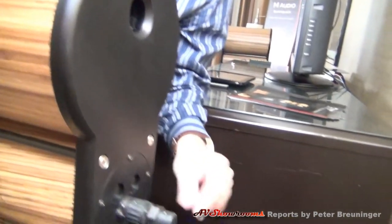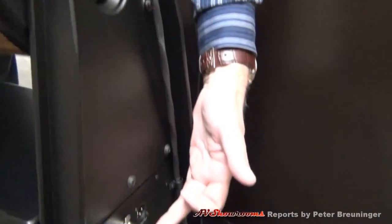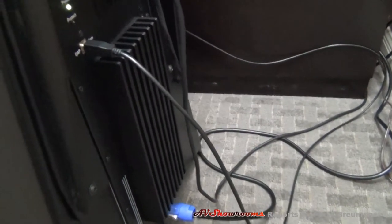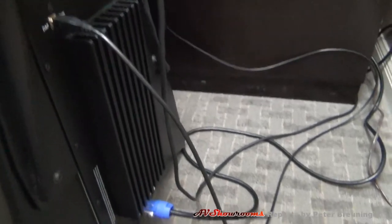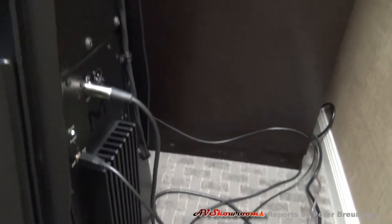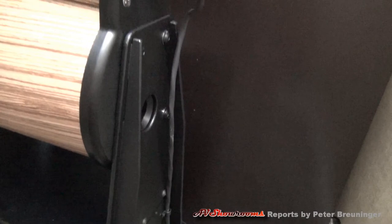I understand. Now, so it is an active three-way. It is. We've got basically cables on the back here that allow us to hook up our top speaker here with a cable interface that brings all the information up to the top set of cabinets. We also have a ports hole for the back. We have a balanced input for the amplifier section. And we also have a USB cable interface that allows us to go ahead and send the program from the computer into the speaker. And of course, you have your power cable to plug into the wall.